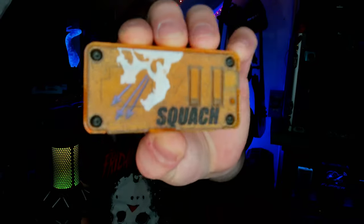I love this textured build plate — it's the same on both sides, so if anything gets damaged you've got two sides. With the textured PEI plate, not only does it give you a really cool surface that translates its texture to your prints, which makes them stick really well, but as the plate cools down, the part actually falls off completely with almost no adhesion. It's so nice to not have to break things off the build plate. I do a lot of printing of cases for Flipper Zero parts, and in the beginning I was having a lot of trouble getting really crisp text. I've spent hours and hours in the slicer printing over and over, and what's great is that it prints so fast you can just use trial and error and knock off five versions of something in a night to really dial in those settings.